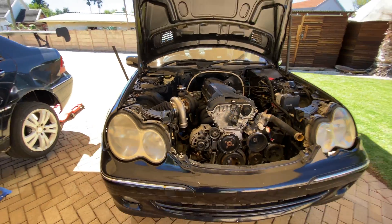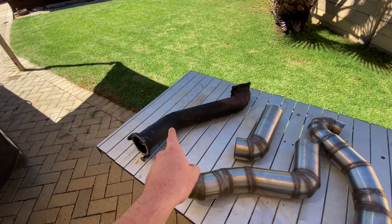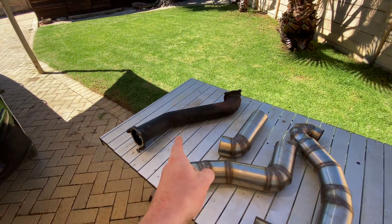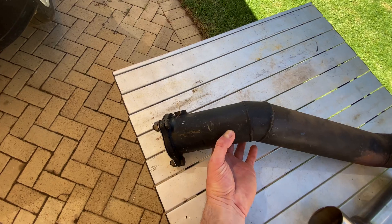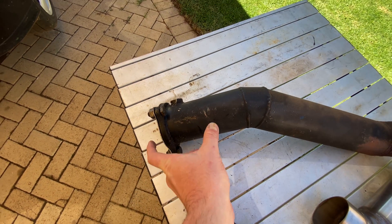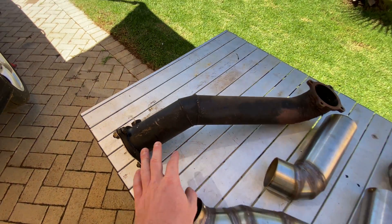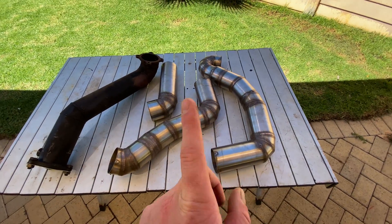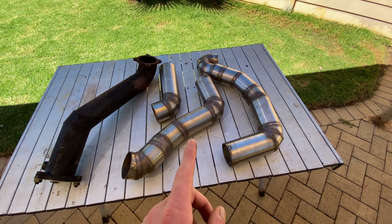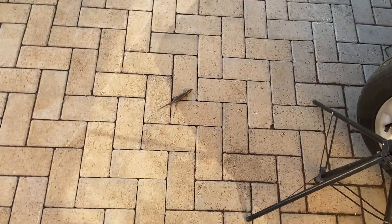For the most part I'm very happy with the results so far, but let's move on to that down pipe. Here I have the old down pipe — obviously that's not going to work with the new setup. I'm thinking I'll cut it off in this area over here because I do want to keep the O2 bung still in there. Then I want to get that flange off and reuse it. I do have a couple of 76mm stainless pieces that I want to do the down pipe with — no real reason for that, it might just look kind of cool. Let's build a down pipe.